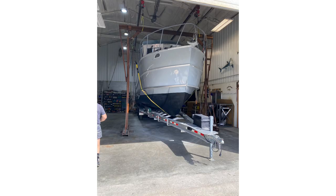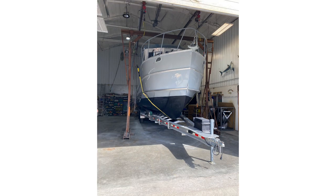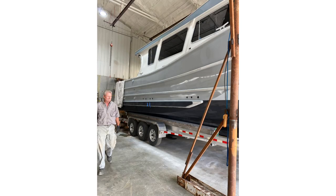You can see also where, when we are doing the work, we pick the gantry up with the overhead one-ton electric hoist. And we could position it to the front real easy. So it made moving it very simple. We didn't have to get real physical ourselves. We let the equipment do the work, and then we slid the trailer under and guided it real slow.